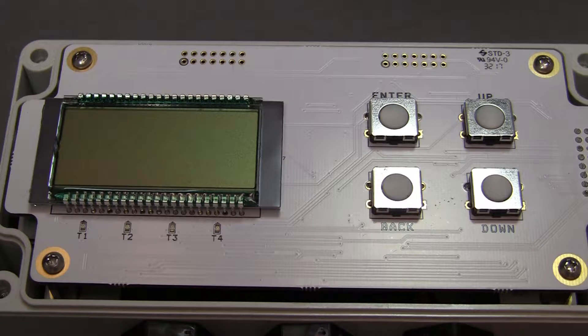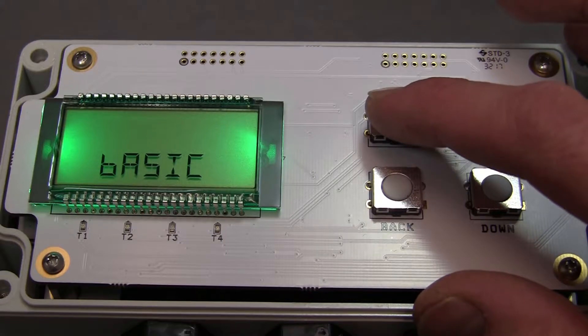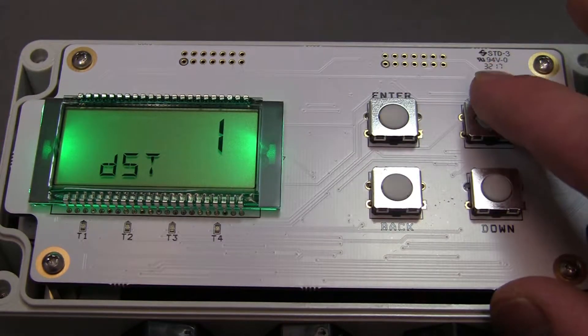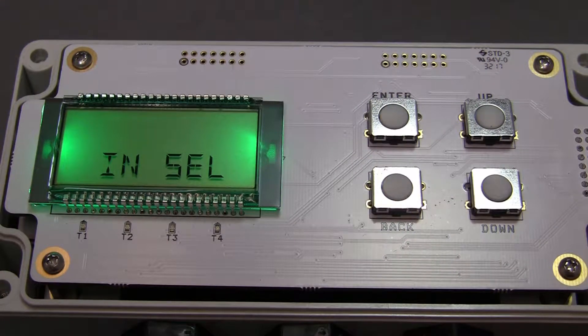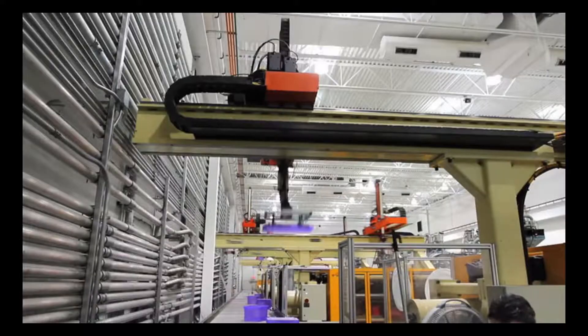The DCR's LCD screen should turn on and the sensor should start audibly ticking. Ensure the DCR displays the distance reading from the sensor. If you are using an RS-485 sensor, use the keypad to access input select from the basic menu and select RS-485. From this point, the setup process will vary depending on the specific needs for your application. For this demonstration, we will set up the sensor to read distance. This type of setup is useful in areas with moving parts, such as monitoring the location of a moving arm on a conveyor and using relay trip points to change the action of the machine.